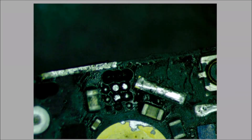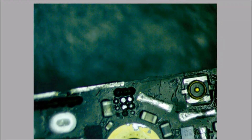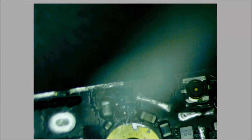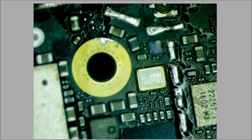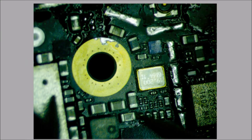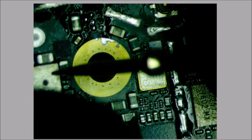Got him out of the way. Let's see if we can just bridge these two lines together. They are definitely bridged together. Now this is our VCC main cap — let's test it. We're showing a dead short on VCC main: 0.7 ohms to ground. Let's inject our voltage again and see if we can isolate where it's getting hot.